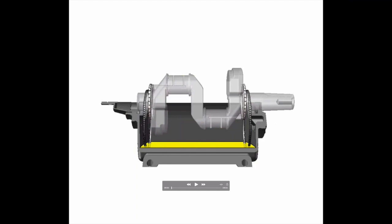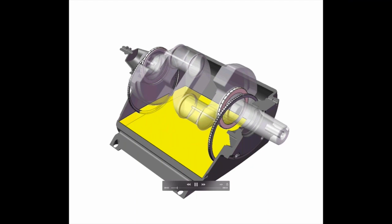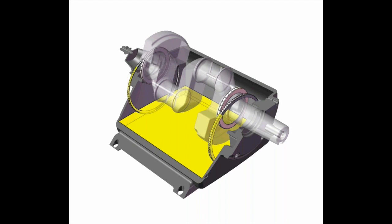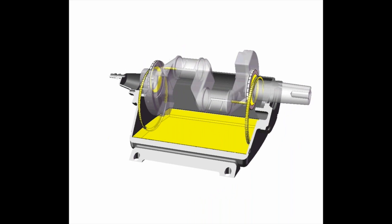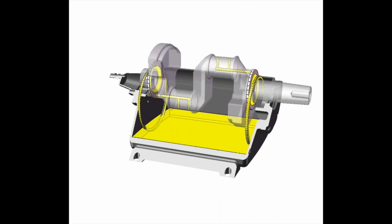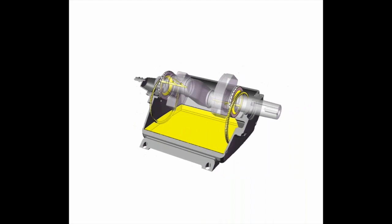And here is one more video. Here we see a cutaway of our 447 crankcase. The oil throw ring scoops up oil from the bottom of the crankcase as it rotates with the crankshaft. The oil travels along the ring where it gets deposited onto the crankshaft. The second ring is the oil cup, which traps the oil on the crankshaft, allowing it to pass through a small hole in the crankshaft. The oil is pushed through these holes and eventually migrates out to the surface of the journals, where they lubricate the connecting rods mounted on the journals.